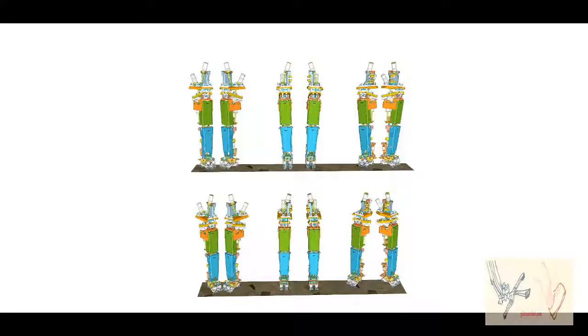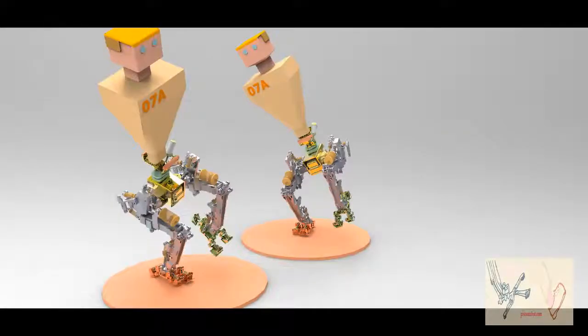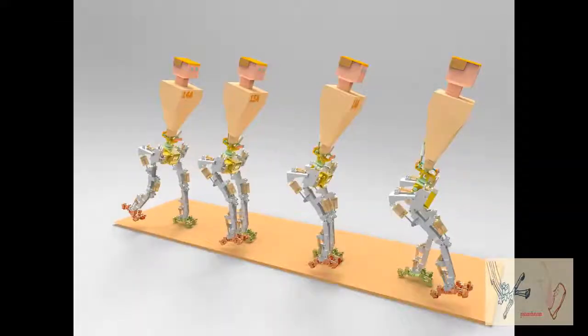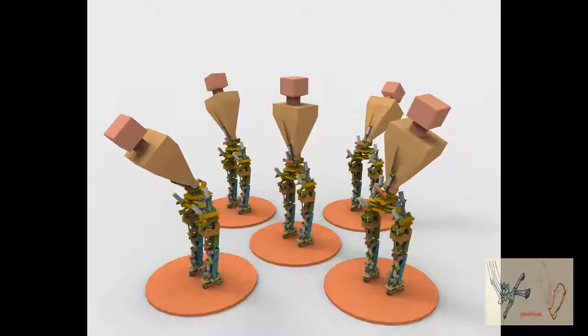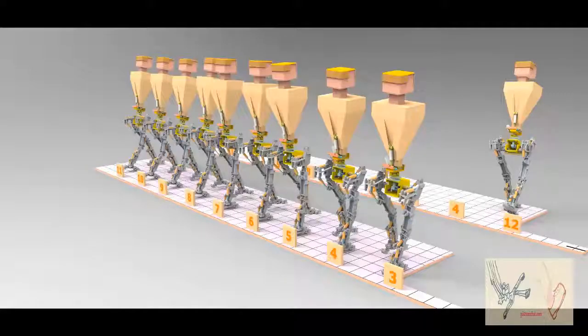The principle of operation of the cylinder is an isobaric volume expansion. We add heat, the gas heats up, the pressure pushes the piston down, and the pressure inside the cylinder actually stays the same. And the work that's derived is from the piston moving down under the influence of the pressure of the heated gases. The crankshaft transmits the power to a water pump that generates the water under pressure, which is used by the piston robot to run the pistons of the robot.